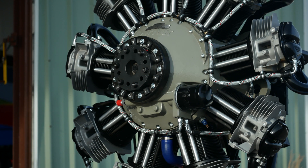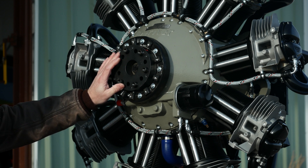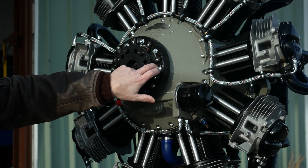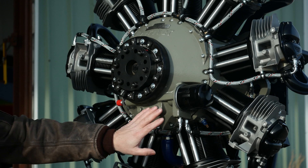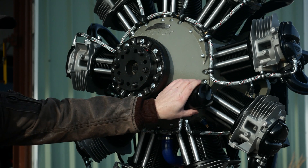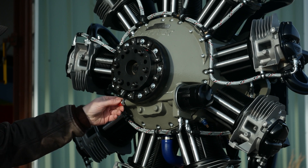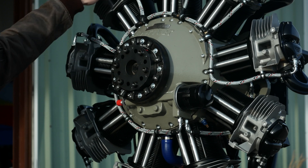Here's a close-up of the front of the engine starting with the prop hub. This is an SAE-1 prop hub with the standard three-eighths bolts and six bolt pattern. Behind that is the alternator and the ignition, with sensors for every cylinder. Here's a Volkswagen-style internal gear-driven oil pump — the filter is right here. Your oil system intake is right here; it uses about a five-eighths hose.